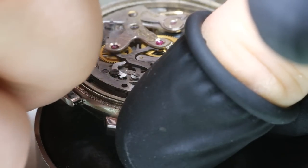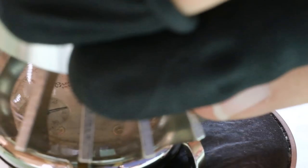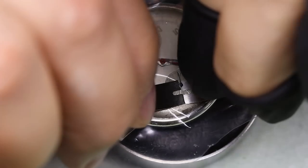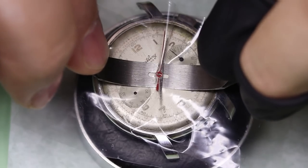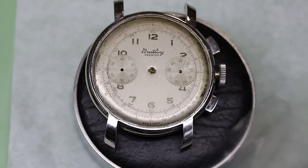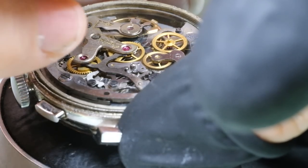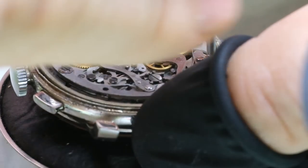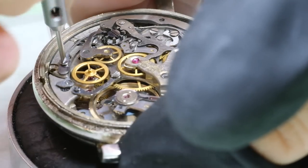We see the crown doesn't want to come out. So what we're going to do is first take off the crystal with this crystal lift, then we can take off the hands. And worst case we can take off the dial from the other side, given that this old movement has dog screws securing the dial — which means there are no screws on the side of the movement, they're all on the train side. Let's release the case screws. There's a ring as well holding the movement in place, due to the pretty cool construction of the pushers that we will see a little bit later.